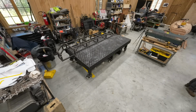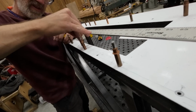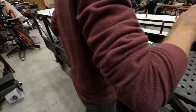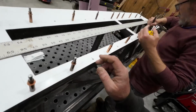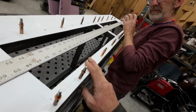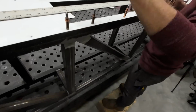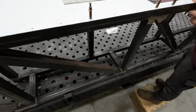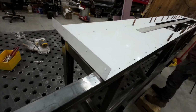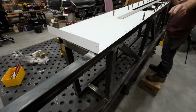Thank you, Strong Hand. Crooked access panel. So what you've drawn there is the edge of where the door will land? Yeah, I'm trying to, so I can center it up. Right, perfect. So you just cut these access panels. These are going to be where you'll be able to get in and wire the neon from inside and also service it. I was going to do 3, but there's only a couple of housings here. You can get to one from here, and you can get to the other from back there. Mm-hmm. So another access panel on the back here to get to all the sockets. Mm-hmm.